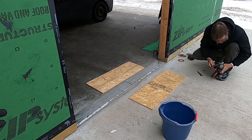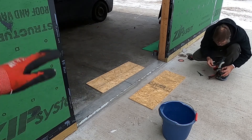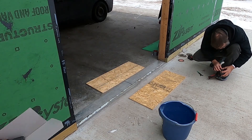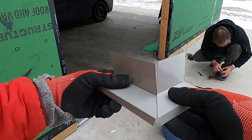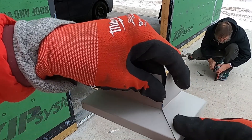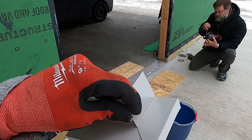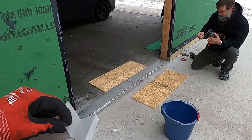Robert has gone through and used an abrasion pad to scuff up the concrete on both sides where we're going to be attaching our peel-and-stick flashing. We've got a concrete blade out and marked the area where we're going to use metal flashing along the edge. The metal flashing is going to look just a little bit like this — nothing too fancy. We're kerf cutting in just about a half inch, and this will eventually go all the way along the porch to make sure any water runs straight off and doesn't weep under the grade board.